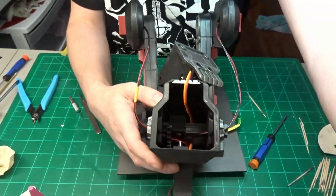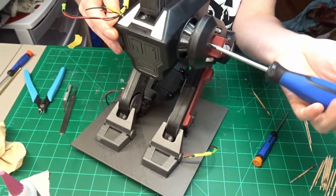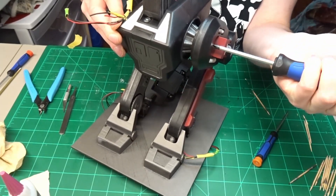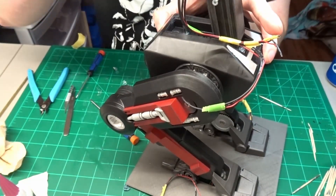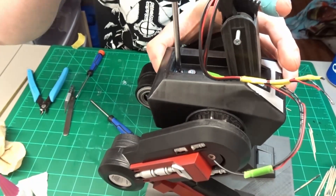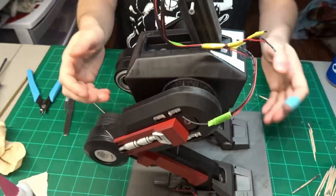As you can see, not much room to reach that rear bolt. Take the booster and booster cover, line them up on the upper leg and run an M4 x 25mm bolt through them to attach each leg to the main body. Level the body on the legs and take two M4 x 10mm bolts and attach rear body panel A to the main body. The servo should match up with the gear inside.